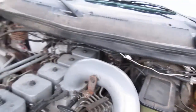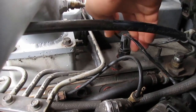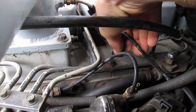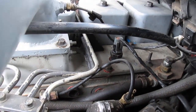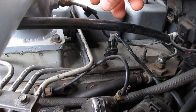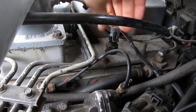This is the intake air temperature sensor. Now this is a thermistor, which basically means it is a resistor that varies its resistance based on temperature. The PCM just checks the resistance and says okay, it's approximately this temperature. Now if this sensor goes bad, it'll be throwing the wrong resistance.